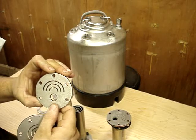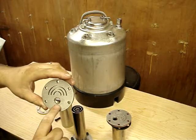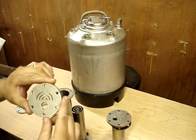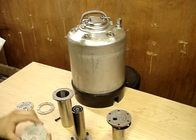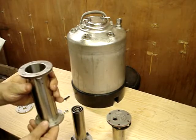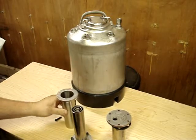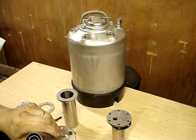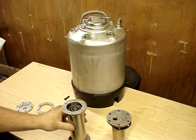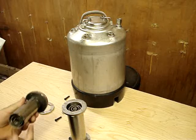holes for mounting to the flange on the top, and a hole for the barbed fitting water port. Same on the base — the base will just be welded right to the bottom two-inch casing. This will have several tubes in it: three tubes on the top, three tubes on the bottom, plus a fourth on the casing, giving you four tubes on the bottom half of this cell, three tubes on the top — the top being positively charged.